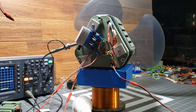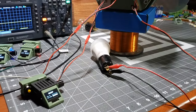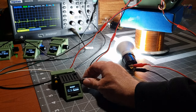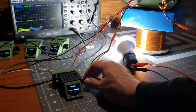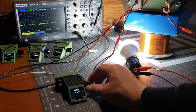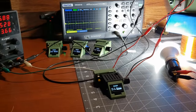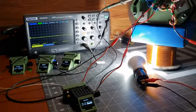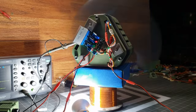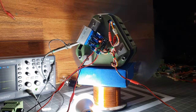Let's see a practical demonstration of this PWM controlling the Triforce from my previous video. This motor utilizes a slotted opto disk to manage its three-phase timing. As the disk rotates, it alternates between blocking and allowing light to pass through to an optical sensor, generating signals that precisely control the timing of each phase, ensuring smooth and efficient operation. The LEDs indicate which phase is firing, and with the PWM controller in the mix, we can finely tune the motor's speed.